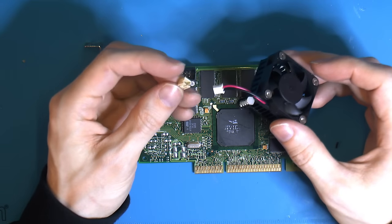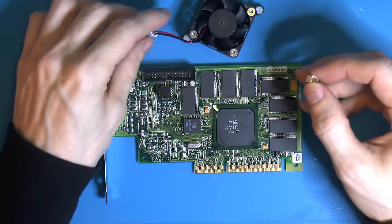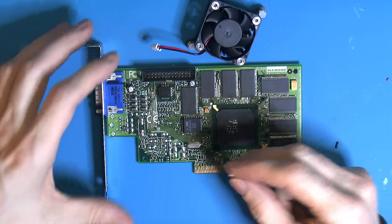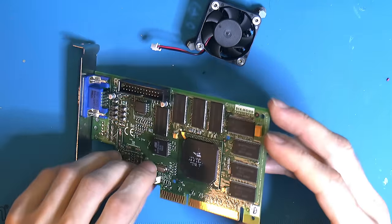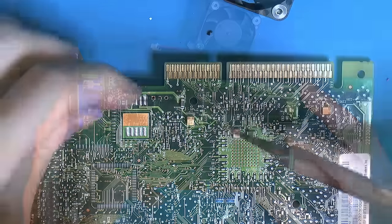So I have this connector here. So yeah, I'm ground in the middle and 5 to the left, so I want to go with 5 volts. It's gonna run more than fast enough to cool this thing. It's complete overkill with 7000 RPM at 12 volts.